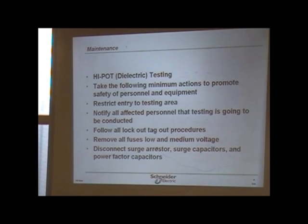This, of course, might trip open, or this contactor might drop out because of a problem or something like that. So it won't necessarily trip as much as it will drop out. Make sense? You got a bad coil or... Right, exactly. Or the contacts, for whatever reason.